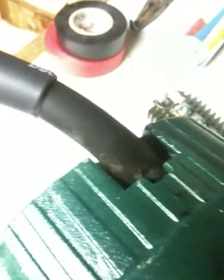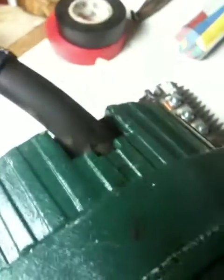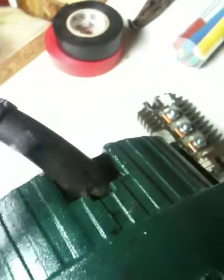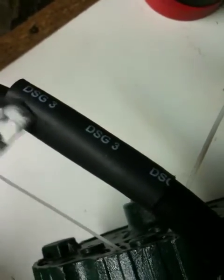On the outside here I used a strain relief — a little rubber piece from a miter saw that broke — just to act as something that doesn't let the wires pull out. And then I'm going to put some heat shrink tubing on — as you can see there's some heat shrink here — and I'll shrink that on just to keep some of the water out.